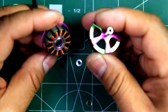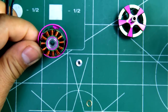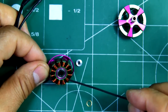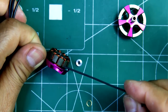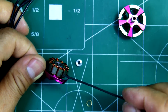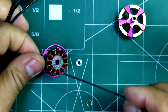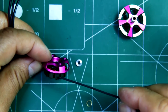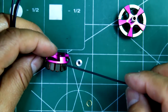One other thing to mention is the windings. As you can see, they're single strand wire and they're rather thick. The laminations — I didn't measure them, but by eye they look like they're 0.15 millimeter. I'll have to double check on that or check the motor specs from the factory. They do look thinner than usual, which always helps with making the motor more efficient and more powerful.